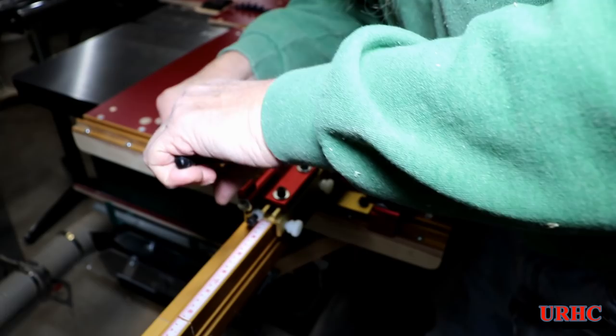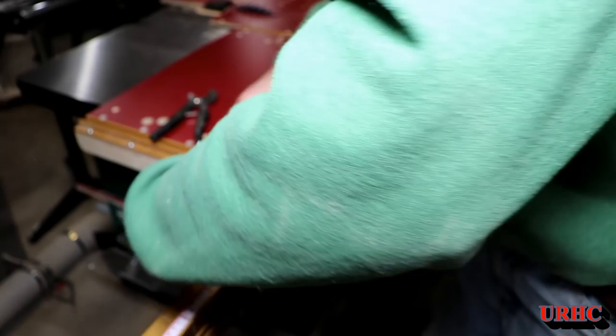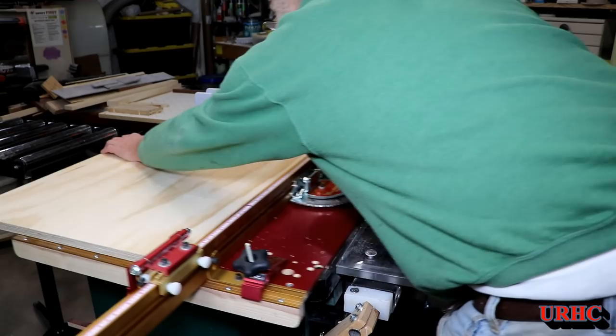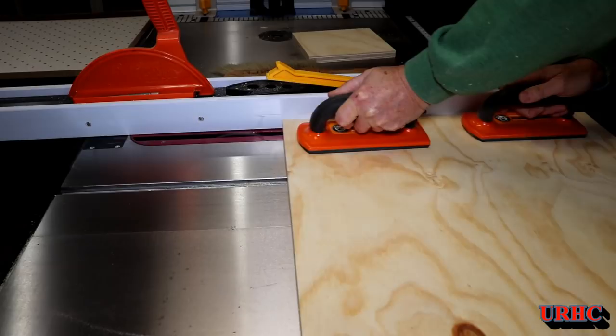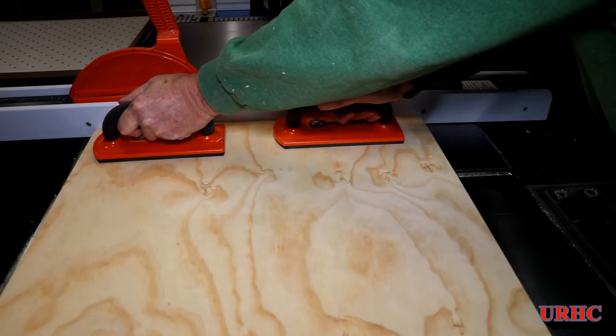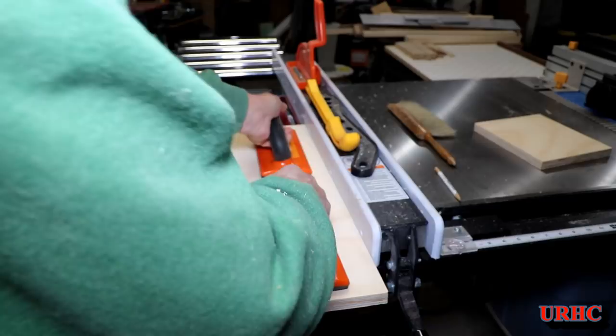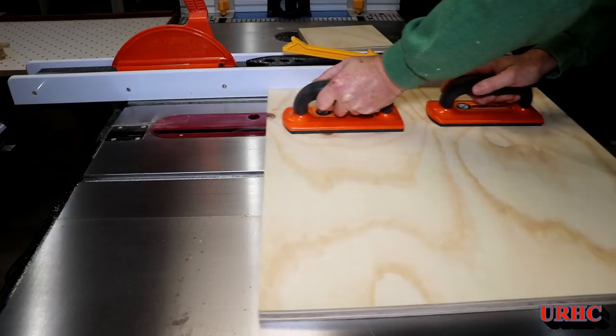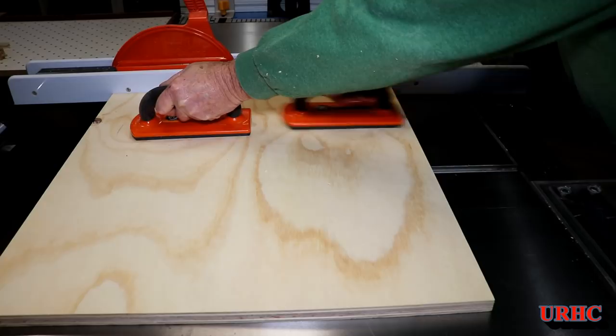Then I had to go back and cut some dados. The miter sled is a pain to adjust — those little knobs stick and you have to use pliers to loosen them, but I'll get into that later. I got the panels cut to size and started putting dados in them to make everything interlock and pull together perfectly square and flush. These little rubber-faced pusher blocks are really handy for pushing things down while cutting dados, keeping them flat on the table so there are no bows or warps in the dado grooves.